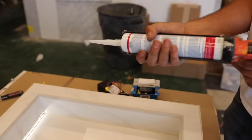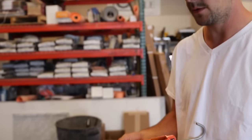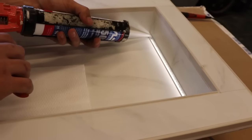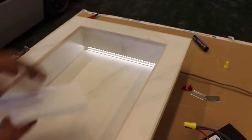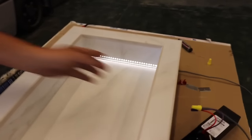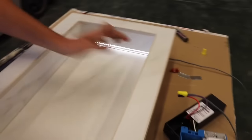We're going to take 100% silicone here — translucent white, a milky white kind of, not quite a straight white. Blends with a lot of stuff. We're just going to cover up and make sure this is 100% watertight — cover up that little spot and do the same thing in the corner over here so that this is all waterproof. They call this LED strip IP65, and that's the code for it being weatherproof. You can put it outside, it can be in the water. So make sure when you talk to your electrical supplier getting you the LED, tell them you want the IP65 so that it can go in a wet area.